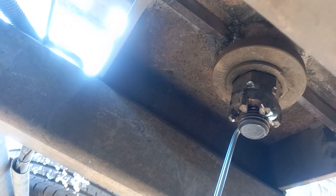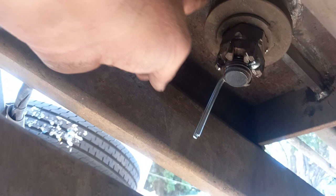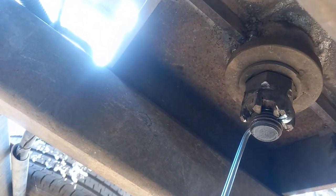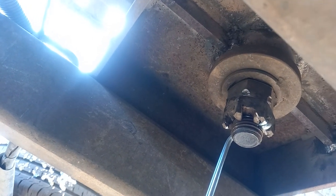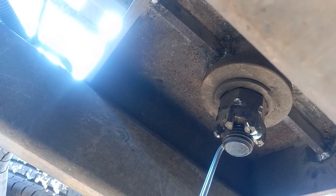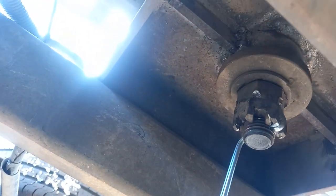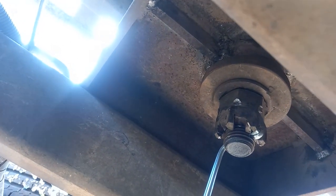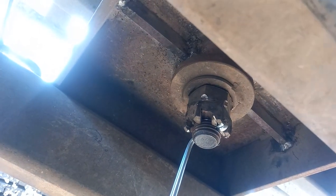The amazing thing was I put a new bush in up here inside — ultra high density polyethylene — spun a new bush and put it in there. I've actually used the same nut, same collar, same everything, and as you can see I've just thrown a new split pin in it.